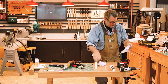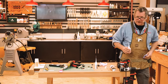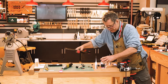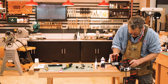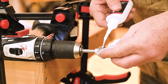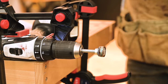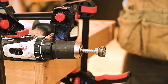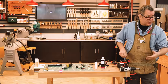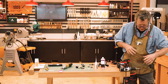And I will usually use a thin, which we have over here. I'm gonna leave a stain here, I'm sure. I'm gonna leave my mark. So putting a CA finish on this, you want the drill to be moving at sort of medium speed. And I just put a bead and just wipe that. What that does is fill in any miscellaneous sanding grits, but it also gives me an idea what this thing's gonna look like when it's polished.